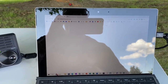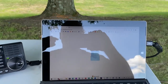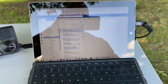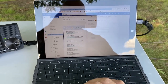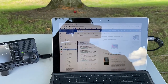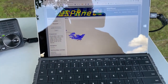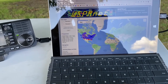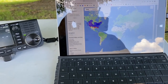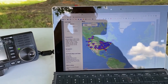It's been an interesting experiment so far. If those of you are watching and have used this antenna before, leave some comments in the comments section about what to do with this antenna. It really should be a match on 40 and 20, because I use an off-center fed dipole at home in the shack and I usually have very good results, especially on 40 and 20 — I can tune it up on 80. Let's take a look at the results here on Whisper. You can see the old results from the previous whisper; we're going to update it again. Take a look at what this antenna did with a really bad SWR.